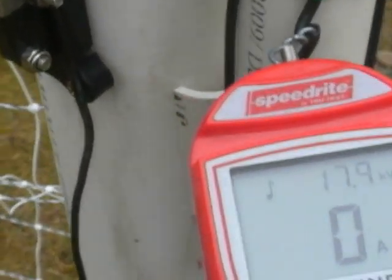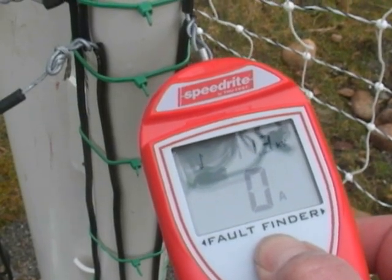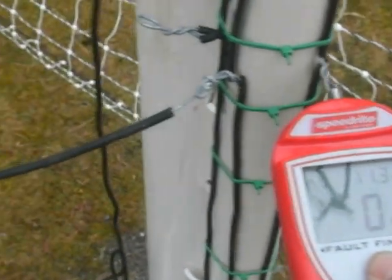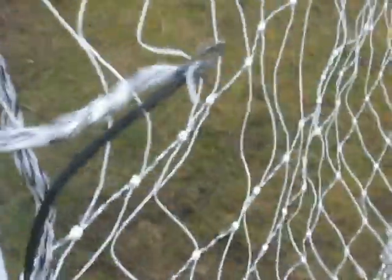Now instead of 2.1, we're also showing in the 11s on the bus bars. I can make that similar test on several locations and always come up with about the same numbers. So this Zareba wire is losing about 2,000 volts from the barn out here in 120 feet — there must be a lot of resistance in it. It's not suggested, and as I mentioned I purchased a 500-foot strand of double-insulated 7-strand galvanized from Premier that also arrived yesterday. It was doing 11.2 over there on the post, 500 feet away.